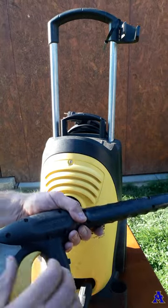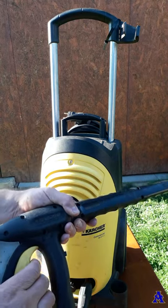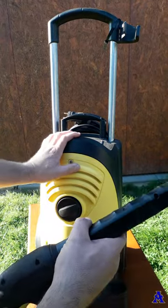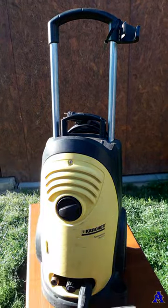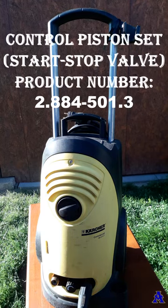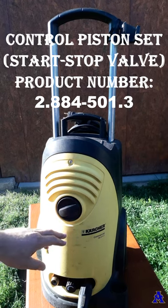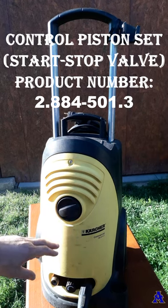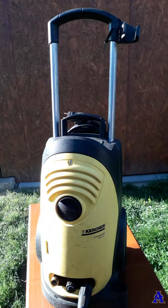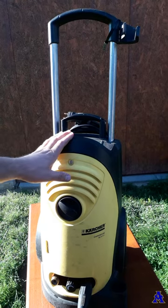And today one guy asked me on my channel that he's got a problem. He's pressing and releasing the trigger and the machine keeps running. And I answered him that I guess that the problem can be a control piston set or so-called start-stop valve or start-stop ventil. It is extremely easy to fix this issue on this type of a power washer.